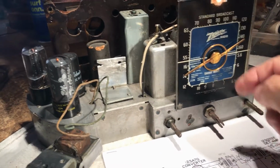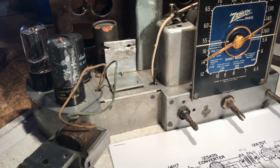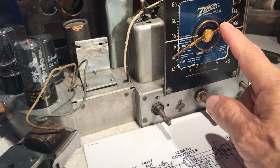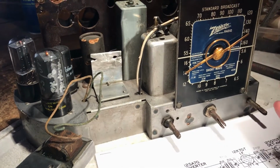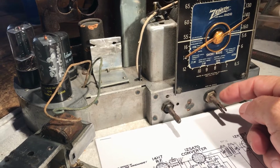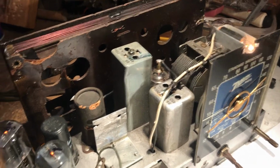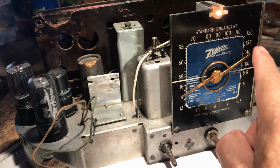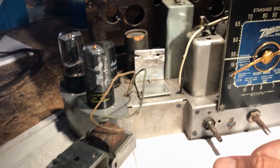Every band switch that's used, in the radios that have shortwave and AM, needs to be really cleaned in order to make sure that the oscillators on both bands are properly functioning, or else you get nothing and you think it's something else. So I make it a point to do this as a priority, and if possible, remove the tuner and get it cleaned. This one here is performing pretty good in that the stations coming in on AM are right on, but we're going to peak it and everything.